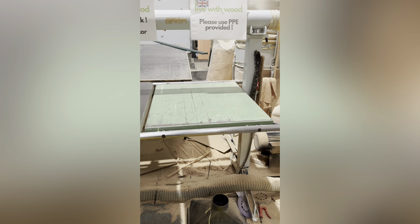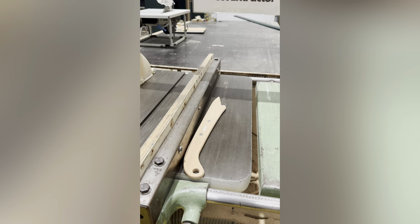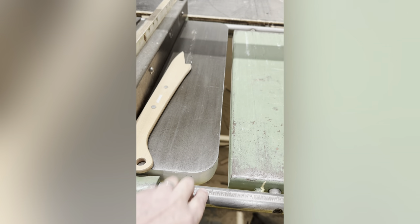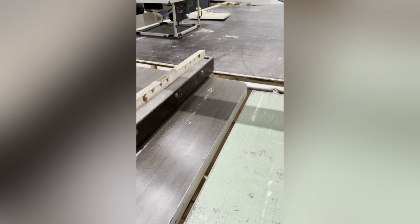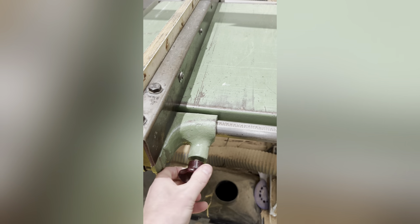This one's got an extension bed — you can see that green part there on the sliding bed. It's actually an extension; the proper bed ends there, so it normally only comes back to that point. But this has got a longer slide bar and this extension, which means we can cut up to about a meter in width instead of about two foot, which is about 0.6 meters. That gives you a lot more versatility. The adjustment is this handle — you lift up and slide the carriage to where you want it. This is a locking lever so it stops anybody moving it when you don't want it moving.